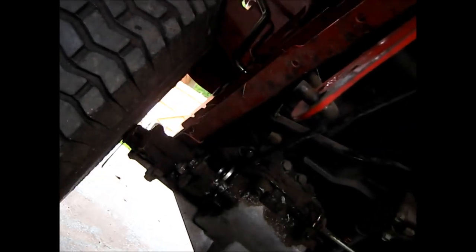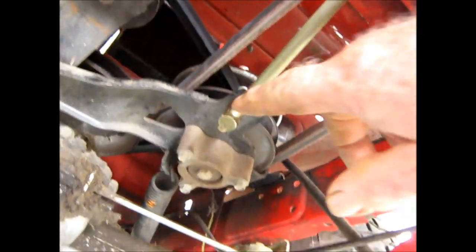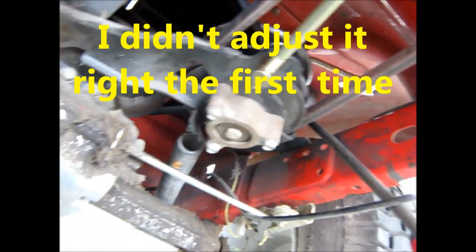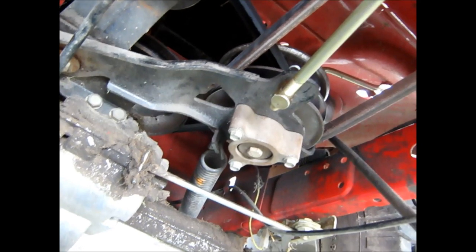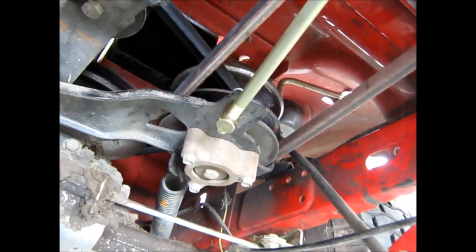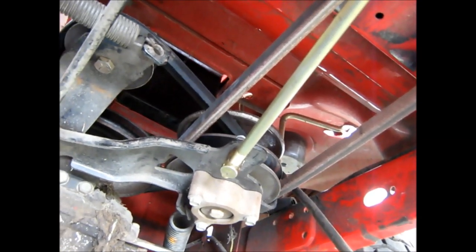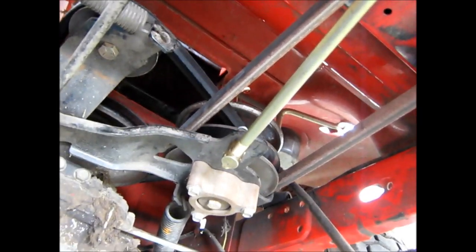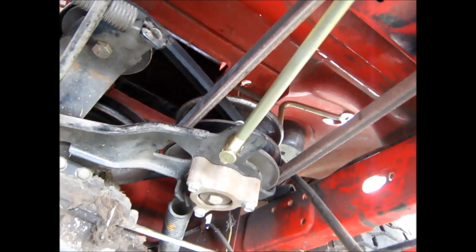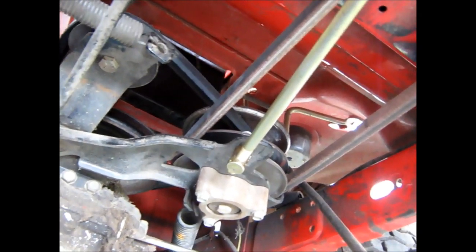I checked the brake and everything — it wasn't causing any problems. It turned out that this adjustment here wasn't letting this belt tighten up enough; it wasn't letting it go back far enough. I put new belts on it, and of course you couldn't tell before because the thing would hardly even pull itself the way it was. I readjusted this, and now it's pulling itself in low gear — before it wouldn't even come up a small hill, not even mowing or anything. It wouldn't pull itself uphill.